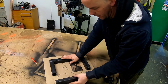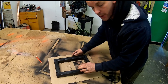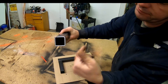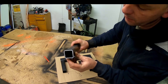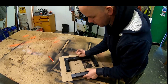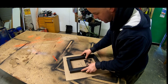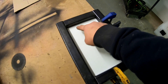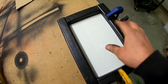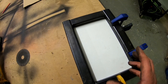These are all cut to length now. We'll put them over our little cardboard guide. The thing we need to consider is the weld seams - there's always a weld seam on tubular or box section unless it's seamless. What I don't like is drilling through the seam because it's usually harder there. So I'm going to point all the seams inbound since we're going to have to drill these holes. I've cut a piece of wood to the right internal dimensions so I know it's bang true square - we can clamp it all up, tack it, and know it'll be accurate.